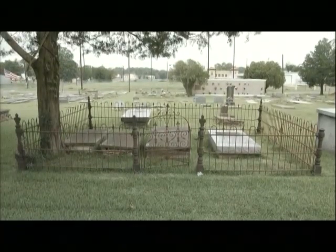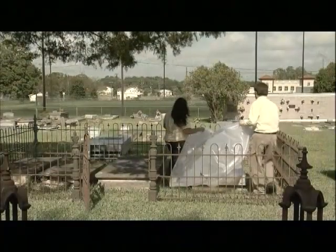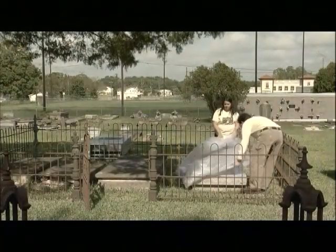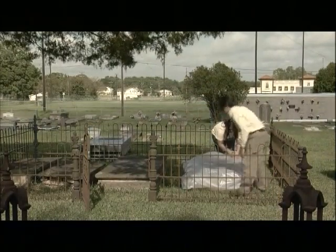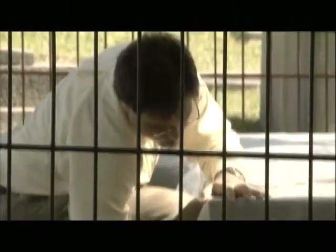Now that we have documented the project, the next step is to always cover up any objects in the area where the work will take place. It's particularly important to cover up any stone grave markers, as well as any stone or masonry curbing that may be under the ironwork. Rust, chemicals, and the paint will all cause damage to the stone.